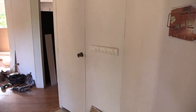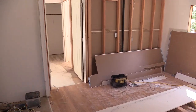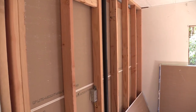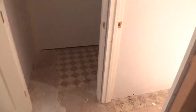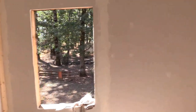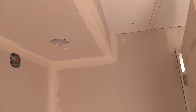It's a 1980 mobile home that needs pretty much everything. There used to be a hutch over here — a cheap built-in paneling hutch — so I took that out and expanded the bathroom a couple feet. The bathroom's got most of the sheetrock in it. I put in a soffit with some lights because the vent pipe used to be here and now it's over here, so I needed a little soffit up there.